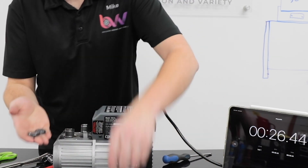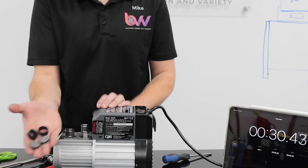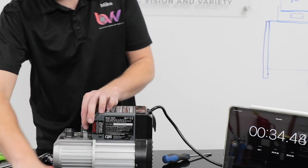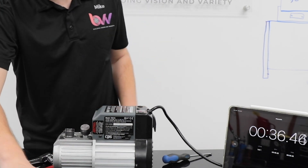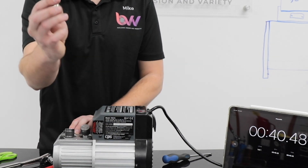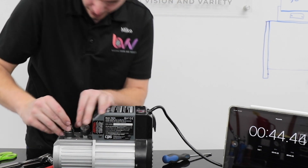Now I have my RK-Mac piston rebuild kit. It's just these four parts — there are two piston heads and two Viton seals for wear guides. All I'm going to do is take this tool. It has two pins on one side and just a 5/8 hex on the other. I'm going to put that in the top of the piston.